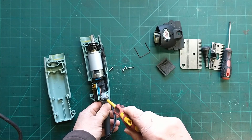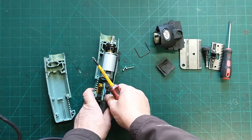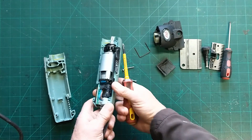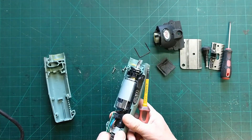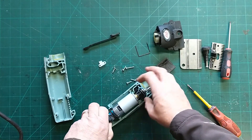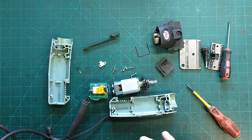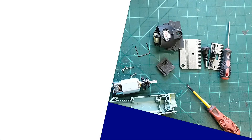Getting this cable out and unattached — there are two more screws in there. That one was actually quite loose, not even screwed up properly. Considering they don't appear to have been apart before, that's probably from the manufacturer. This one was loose as well, not screwed up properly. The cable can come off now, pull that cable clamp out. All of this is loose, there's nothing on it. This part is the switch, it just sits off. Not really a lot to clean up — I'll give them a quick blow over, tidy them up a bit, see how we get on. Otherwise that's a set of Lister Star horse clippers stripped apart and ready to be serviced. See you in a bit.